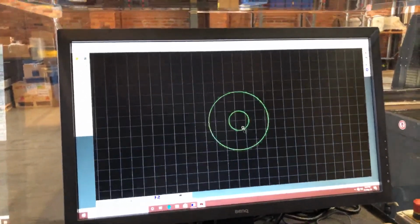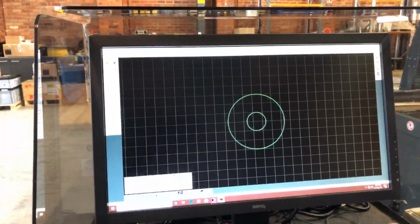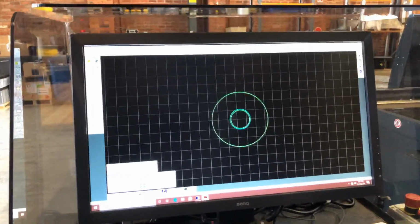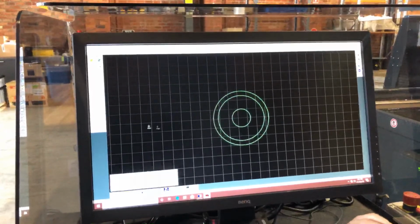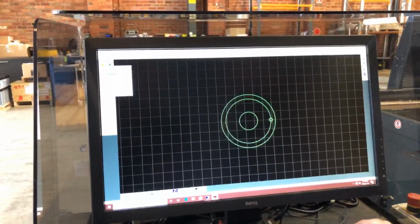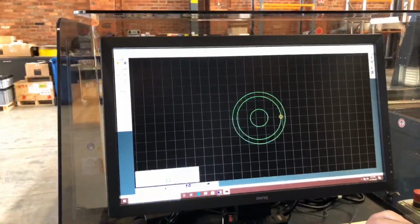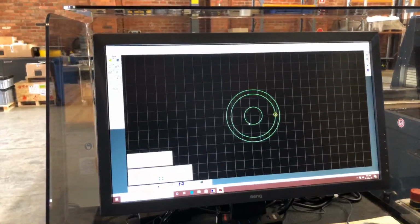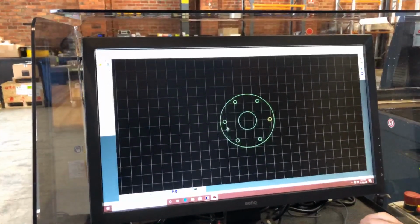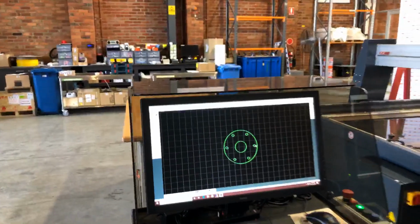Now, I'm going to need to put circles on a PCD. So again, I need to put my PCD down. So that's another circle. I'll put that at the center of that little one. We'll do that at 125 mil. Next are small holes. We'll make those 10 mil. Now I just need to select that hole there and rotate that around. So let's do 6 of them. There we go. Now I'm just going to get rid of the PCD line because we don't need that. Okay, so as you can see there's your simple pipe flange.